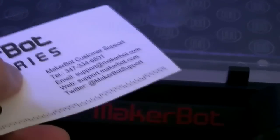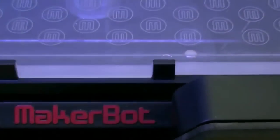So when you manually level the plate, it says that you have to use this card, and that the extruder head shouldn't leave any trace, and there should be enough space to let this card go between the plate and the extruder head. It says that you have to use this card as a reference when leveling your plate, but the true reference is that you shouldn't encounter any kind of friction between the extruder head and this card, for example, because if you encounter any kind of friction during the printing process,